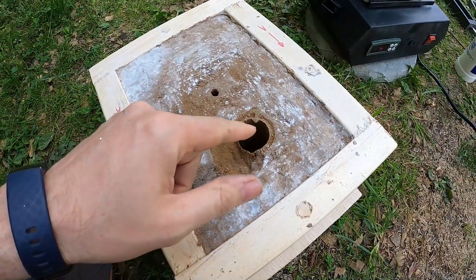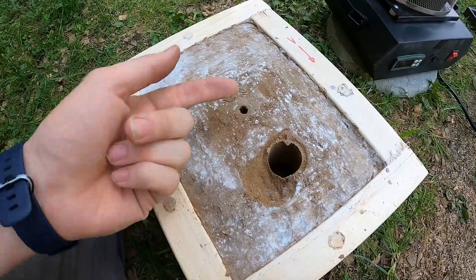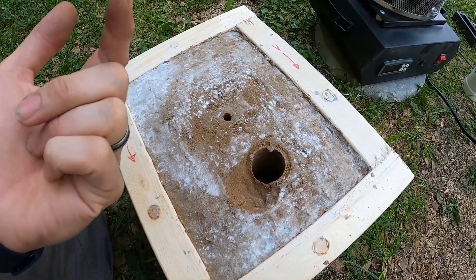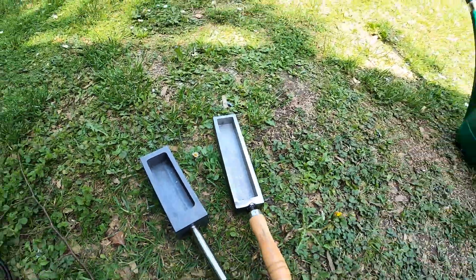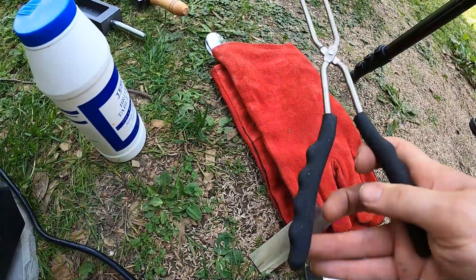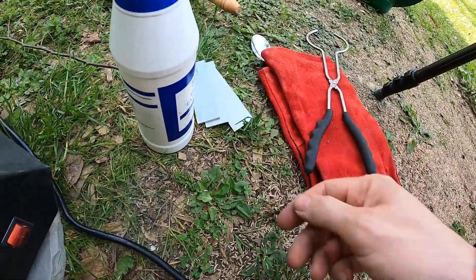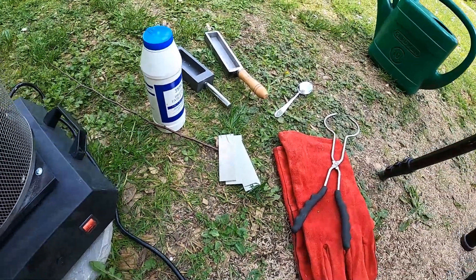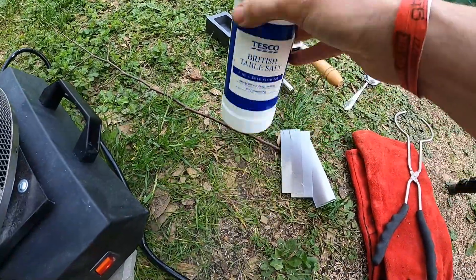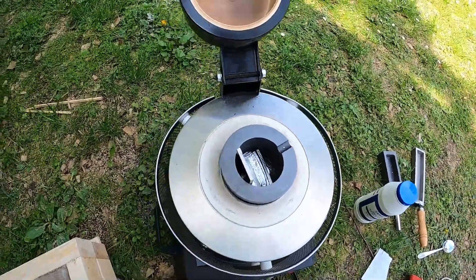The mould is finished and ready to go. This hole here is our feed-in — where we pour the aluminium — and there's a little well so the aluminium can feed in. This is our air hole; when aluminium pops out of there, that means the mould is full. Once full, we move over to the ingots and pour any remaining aluminium there to empty the crucible. We've got safety gloves, a gadget for picking up the crucible, a few pure bits of aluminium for decent material, a spoon to skim impurities off the top, and some salt because that helps with the process. The aluminium is nearly all melted — almost a full crucible.